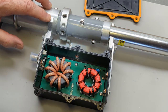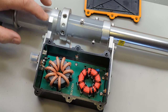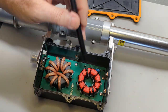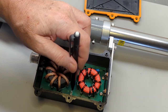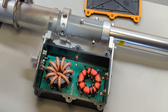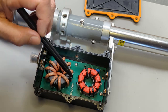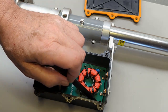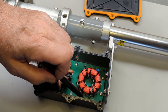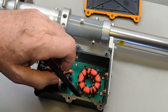I'm just saying it seems to me - don't send me hate mail - but I don't like this. I think this is sort of cheesy. I did see a guy online who replaced that with a 47 picofarad doorknob capacitor, which of course is potent. Somehow K5GP is in there - I don't know why. I looked them up and it didn't seem like it had anything to do with this design, but maybe it does. There are a couple of spots here for components which were not included - there's a little jumper on one of them. One is this RFC, this radio frequency choke, that the more expensive antennas have. That's missing here. Is it necessary? Probably not, but it's a good thing to have.